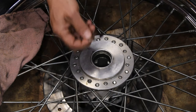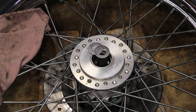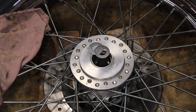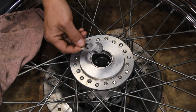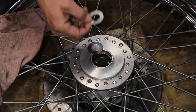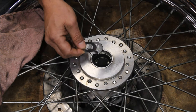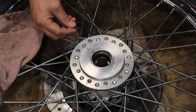I'll tell you a little trick — you don't have to have a micrometer or a dial caliper to change your shims out and know which ones to go to. It's a lot faster with those tools, but what you can do is just take your thinnest shim, pull out the kit, and the next one is just a little bit thicker — put that in. It's more time-consuming, but it works. Let's get this bearing in.